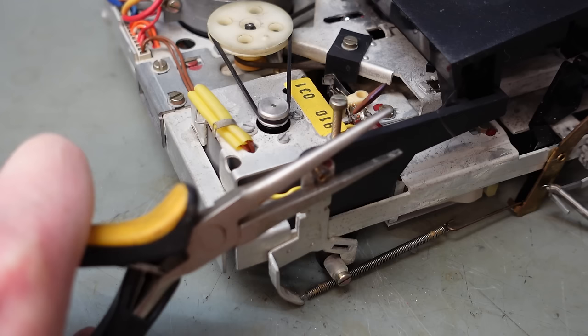That's already what the level is when it's stopped. Let's press play. Well, that's no good. That's too negative. I wonder what could be pulling it down. This is a negative rail, by the way. Although it's at the top, you think it's positive, but it's not.